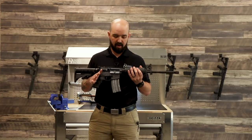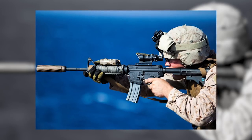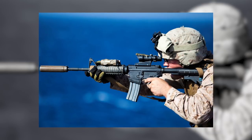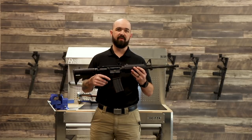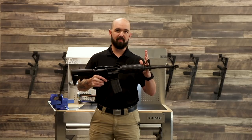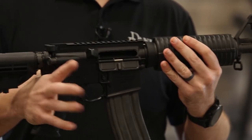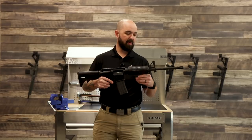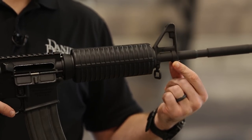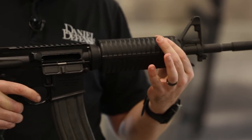Moving into the mid-90s, this is where we come up with the M4A1. Starting from the front: the biggest change was shortening the barrel from 20 inches down to 14 and a half inches. When we did that, we also needed to shorten the gas system and increase dwell time to ensure that the rifle could operate with that shorter barrel length. The front sight base is still relatively the same — still adjustable for elevation, still has a bayonet lug. Everything got shorter, including the handguard, which is basically an A2 style handguard for that carbine-length gas system.